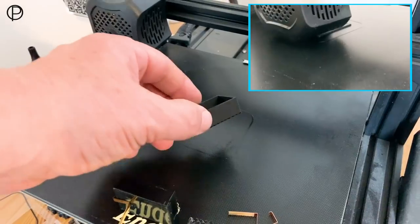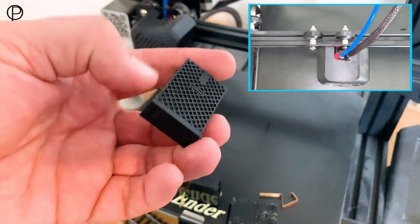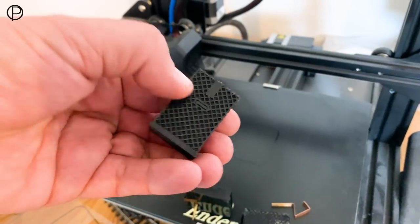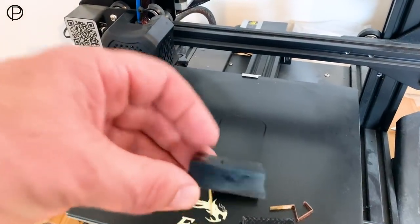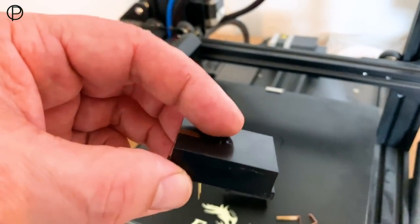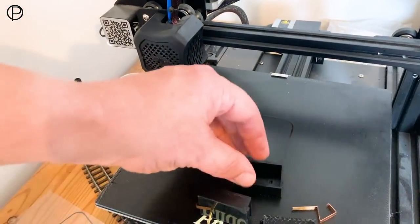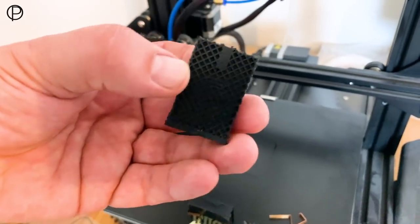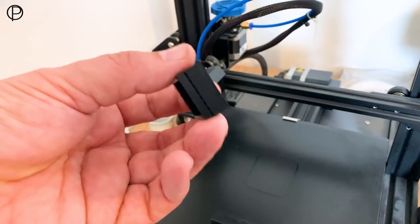There we go. Because of the design of the model, it has what's called support structures. If you see that little piece there, that little protrusion, I think it's required to hold the sandbox inside the tender. The top of the moulding pushes that down and holds it in place. So to print that and lie it flat, you need to print an area around it, and that just simply pulls away, or it needs a little encouragement with a scalpel.